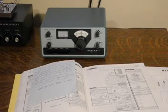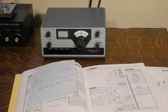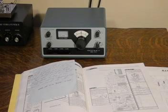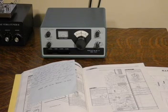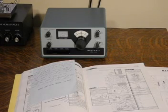According to a handwritten note in the manual, some of the front-end toroid coils were assembled incorrectly in the wrong locations. Looking at the assembly manual on the radio confirmed it, and it appeared to be not quite as sensitive on the 3.5 and 7 MHz bands as it should be. I removed the toroids — quite a job as the PCB needed to be partially removed — and reinstalled the coils correctly. Someone had also installed an extra capacitor on the bottom of the PCB across the 40-meter trimmer cap to compensate for the inductance of the wrong coil. I removed that too. The mystery is: who figured out that the toroids were wrong — the original builder or someone later? Kudos to whoever figured it out, but why didn't they fix it? Anyway, after 30-plus years, the radio is now working as it should.